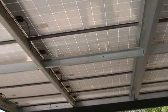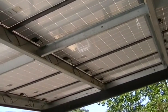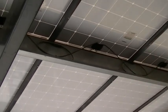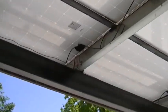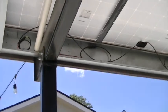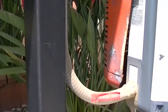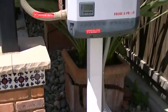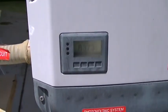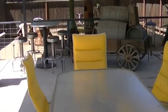The wiring is all done across this side here on what are called Z purlins. That's how the wiring looks on the DC side. We use PVC pipe and then transition it down to liquid-tight conduit. Here's the inverter — this is a Fronius central inverter called a Snap Inverter — and everything is tied into that. Right now this system is producing 8,300 watts, so it's a good producing system.